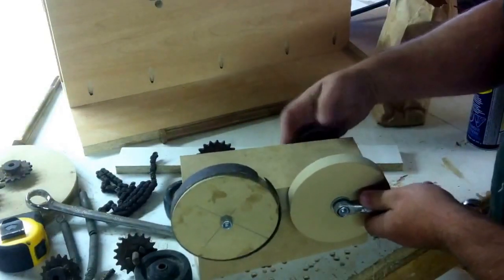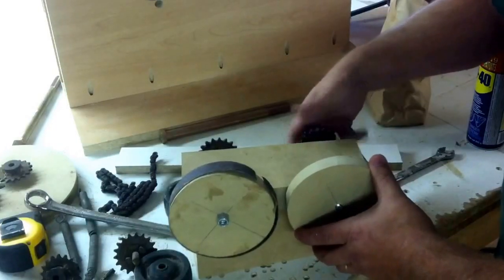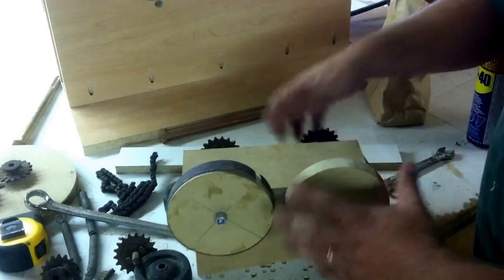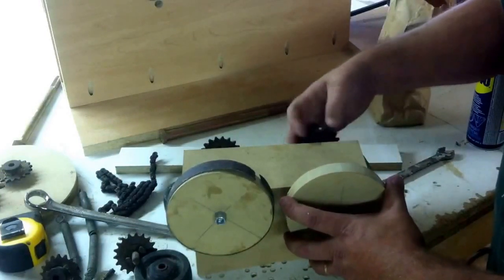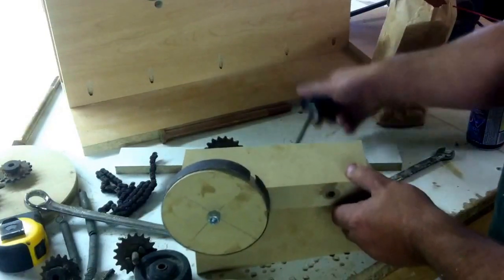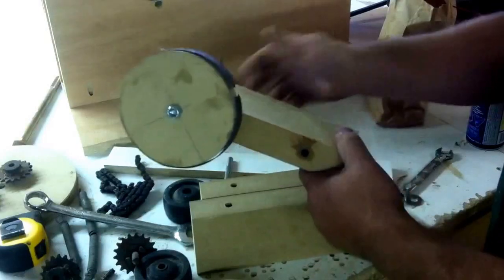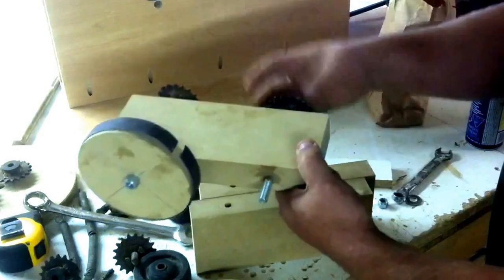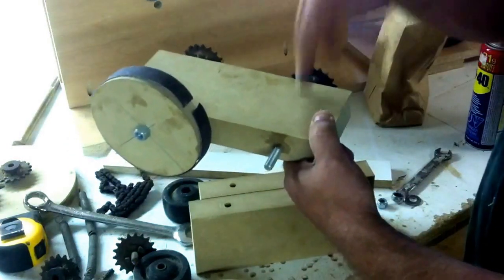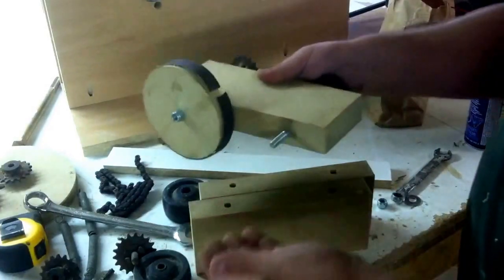What I've got done here — I'll just take one of these right apart. I actually threaded this little wooden wheel. I did some tests before this to see how much torque this was only going to be able to handle, just being threaded on like this. And this is going to handle any amount of torque that this little feeder is going to throw its way. So it's just threaded on there. What I did was just drill a hole through this MDF — this piece is about three and a half or four inches wide. I just drilled a 3/8 hole through it, sprayed it good with WD-40 when I was done. Then this bolt runs through — so there's what I'm going to run for a shaft. I'm not even going to put bearings in this thing, because I think this thing will take forever to wear out. It's a smooth shaft running on hard MDF material — it's going to take forever to wear out. And even if it did get a little bit of play in it, it's still not going to hurt anything. It just makes it super easy to build — you just got to drill a hole through a block of MDF.